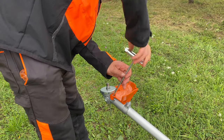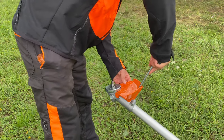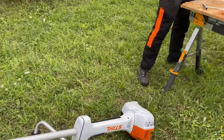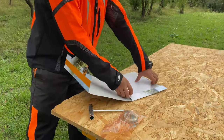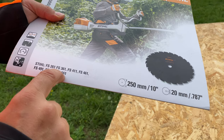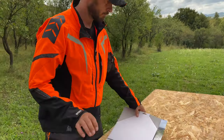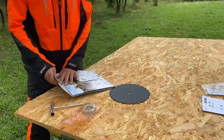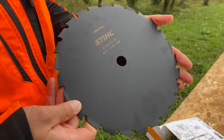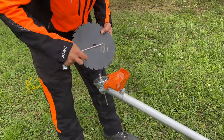I am definitely very excited to try it out in the field to see what it can do. This circular saw blade is brand new and is compatible with the Stihl FS261, 511, 561, and also for this type of brush cutters. We're going to have a video with this circular saw blade in the future to see how it's cutting and how it's performing. We have arrows to see the direction of rotation.